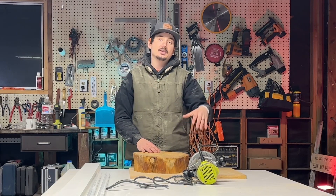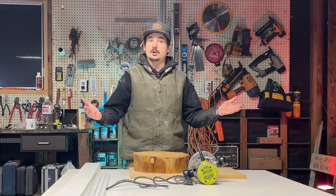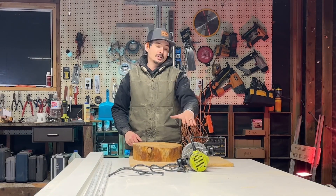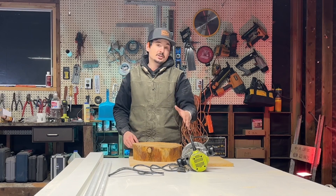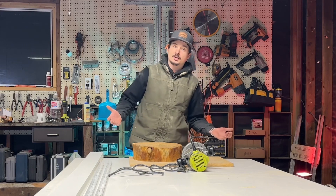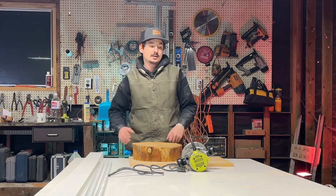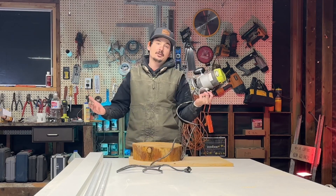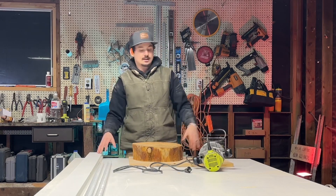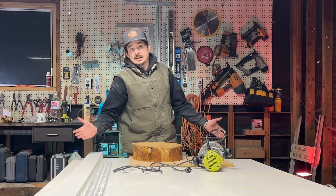You could build one of these if you wanted to level slabs, or if you didn't have a planer and wanted to build a glue-up slab out of pallets or old wood. A leveling jig for your router is much cheaper than buying a planer. If you have time but not money and want to flatten a piece of wood without expensive equipment, you can buy a router and build a jig using materials you have around.